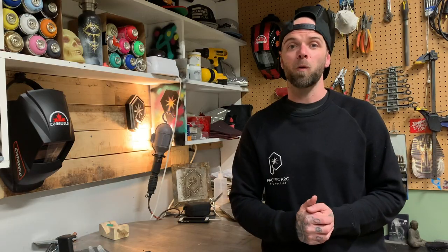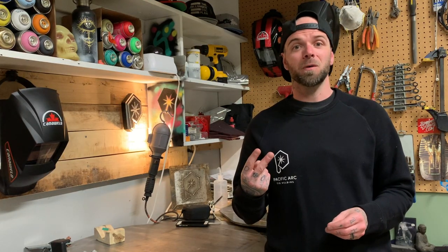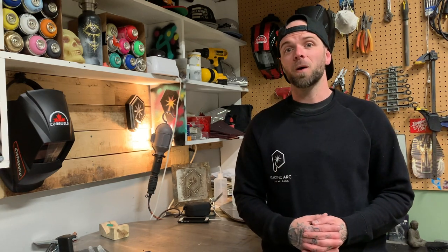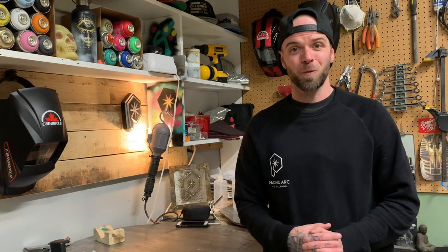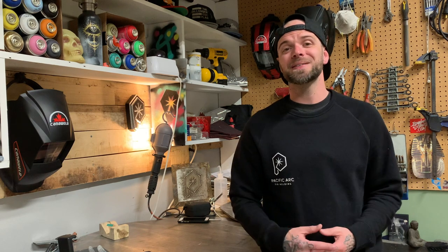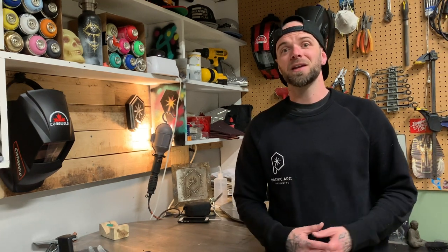That's very, very important. So basically the two things to remember are very comfortable hand, you don't want any restrictive hand posture, and you wanna be constantly aware of how far you are away from your weld pool. Once you master this small detail here, things will get a lot more simple for you, I promise. Your weld pool will form easier and cleaner and more consistent. You will get better filler rod break off in the pool with less contamination and arc deflection.